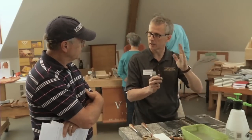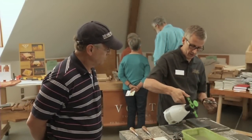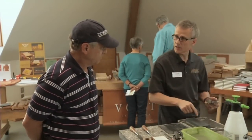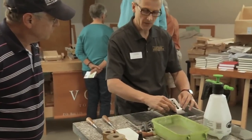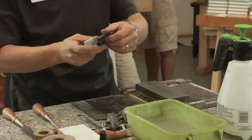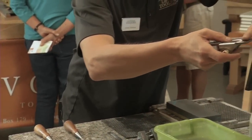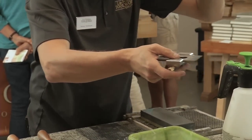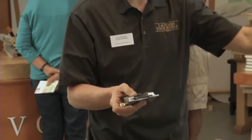That secondary bevel makes the edge more robust — it fattens the edge, so there's less chance of it yielding, bending, and then breaking. I now go to the coarse stone, which is a 1000-grit stone. Place the wheel down first, then the blade edge, and just a few strokes — then test whether or not you've raised that burr. Run your finger off the edge that way and you can feel a little rough line; that's what you need to feel to know you've actually achieved a fresh edge.